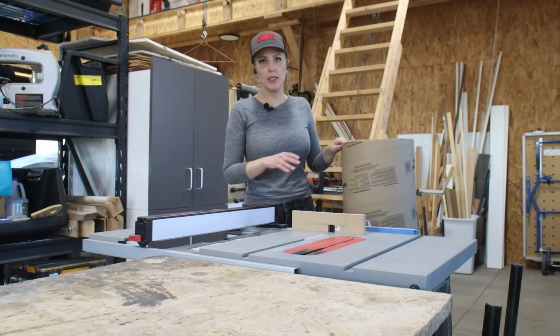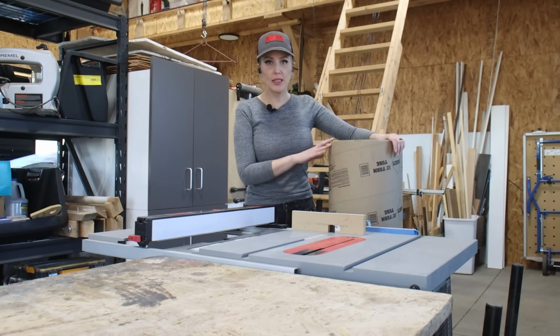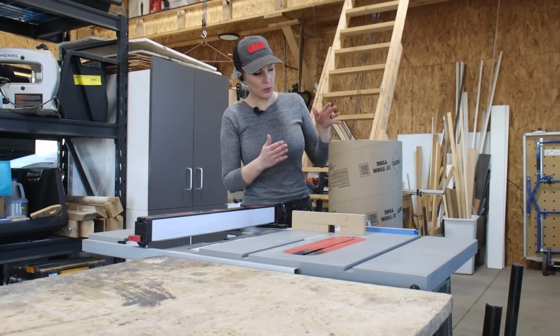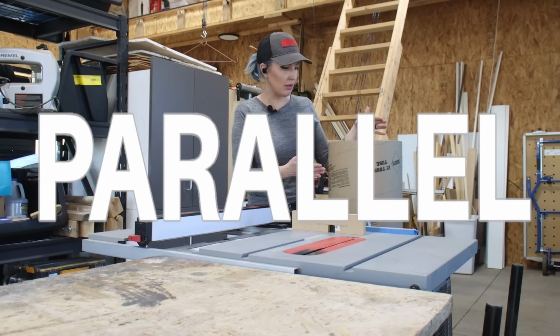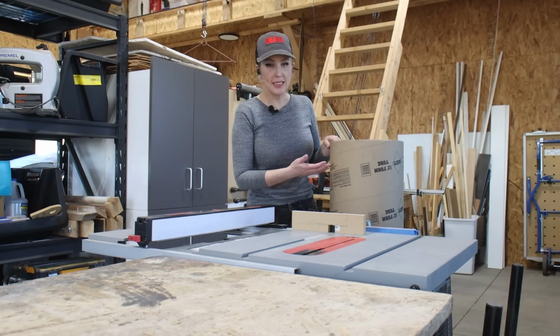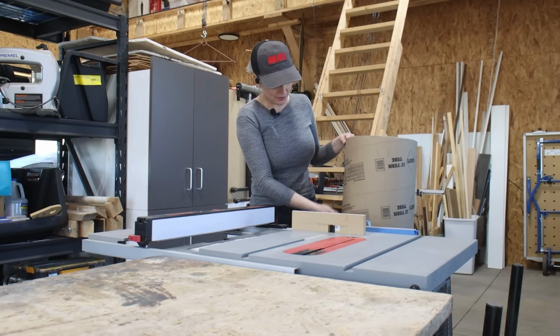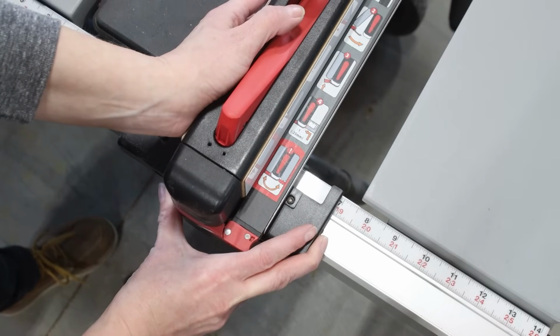Normally, I would probably cut this concrete form tube with a reciprocating saw, but with the design of my table, it's really important that the bottom and top edges are perfectly parallel. I want to make sure that my table sits vertically. So to get as parallel of a cut as I can, I'm going to be using my table saw, and I've got my fence set up.